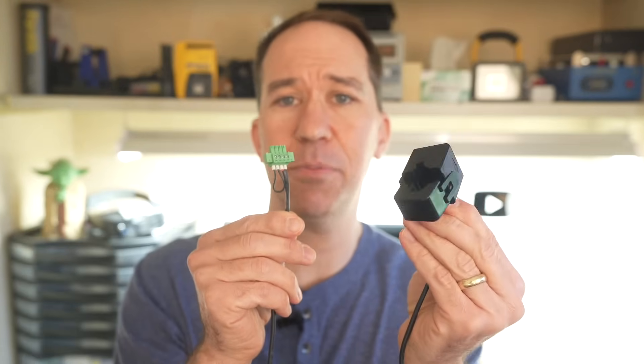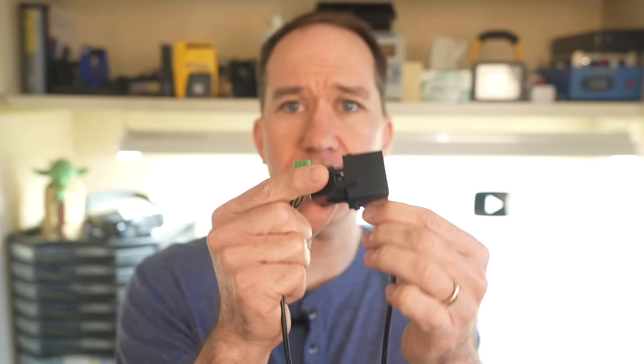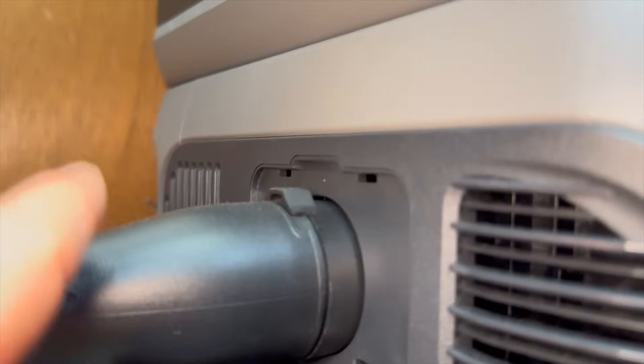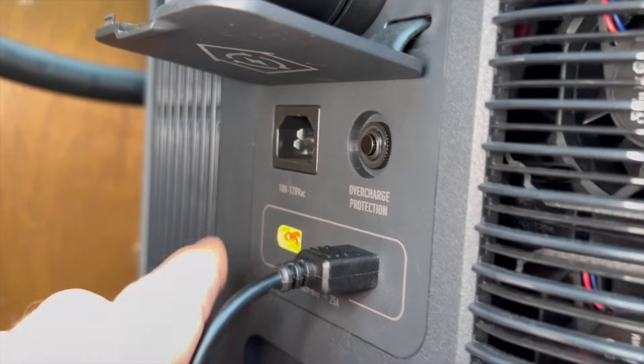I have a solar array on the roof, but I'm not using the solar current sensor that plugs into the home power panel. This is because my solar point of connection to the grid is outside the house — it's called a line-side tap. A more common setup is to back-feed into a breaker on your main panel, and in that case, this sensor is easy to clip in and plug into the home power panel. I also have one-to-one net metering, so it doesn't really matter what time I charge the batteries. The solar sensor connects onto the 120-volt line coming out of your inverter. When the solar inverter is generating more power than the house demands, the home power panel takes that excess and charges the batteries. When connected, charging happens through the connector at 240 volts AC, so you can't use the 120-volt AC port at the same time — but you can recharge with the DC inputs.